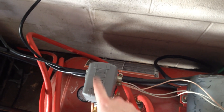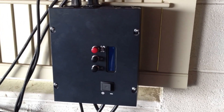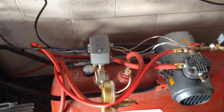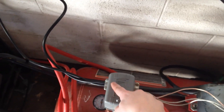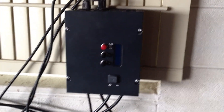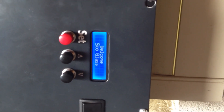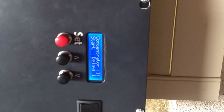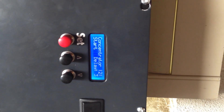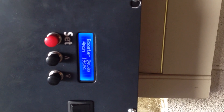The only thing that's really hooked up to this pressure switch itself is my box — it's a relay box that turns everything on. The motor is actually just kind of wired together in here, it's just one continuous wire. So this box here, when you turn it on, it greets you. It'll turn one concentrator on, wait a desired amount of time, turn the other one on — which it just did. And then after it does that, it turns the boosters on at a desired time.